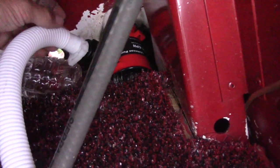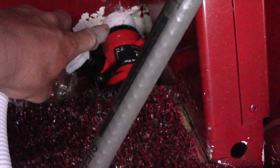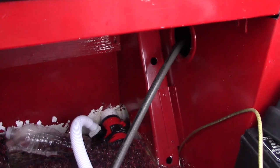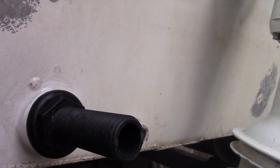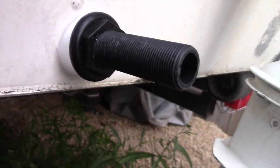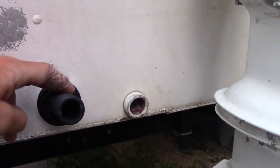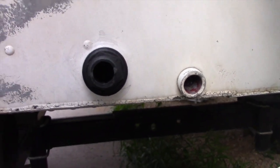This screws on there and then you put the hose from the aerator on there, then you have the hose clamp. There are two shims that come with it — the flat piece goes against the pump on the inside of the boat and the slanted piece goes on the inside of the stern at the back. The flat piece goes on the nut. They don't include a mesh cap that keeps junk out, so I would recommend buying one at a marine store for five bucks. So I have about 115 dollars in this — it's worth it, pumps water in real nice, and I had no problems with it.